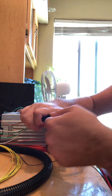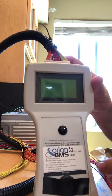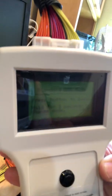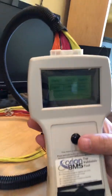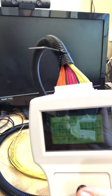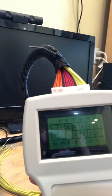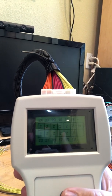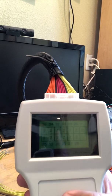So how do I know if they're right or backwards? This is where the tool comes into play. I power on the tool and it says: bank three warn, bank two warn, bank one good — that's because I've only hooked up one set of wires. The cool thing is it shows the actual pin out, and they're all C's, which means correct. Pins one through twelve all show C. Then bank two shows all Z's — the last letter of the alphabet because none of them are connected — and same for bank three.